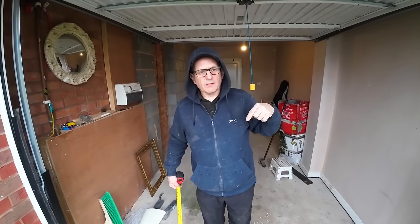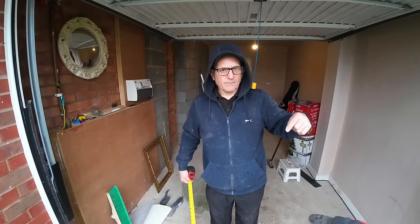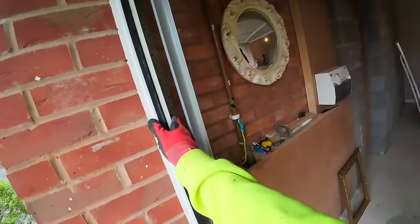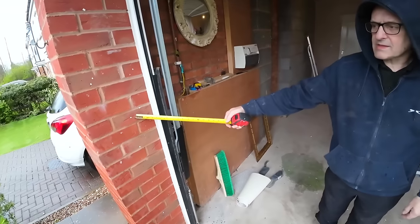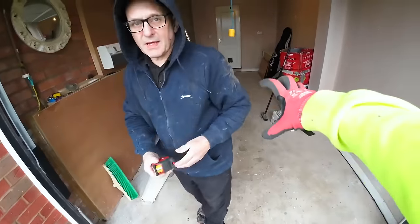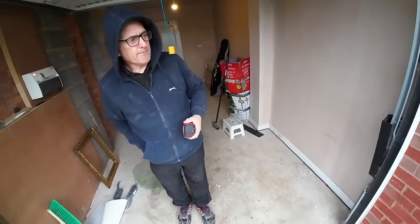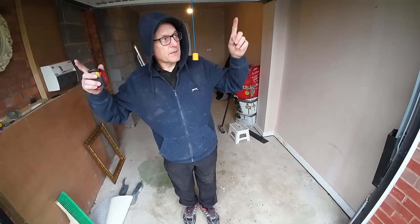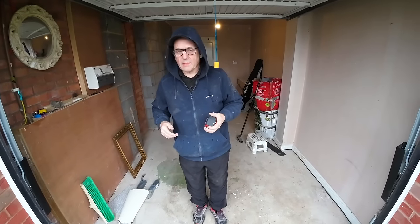Because it's an existing building, we don't have to. We can go off the existing build, since it's already here. We don't have to do the 150mm. Yeah. Plus, it'd just be easier to do the 100, because it will flush up with the wall, and there's no awkward. Yeah. It'll probably be about 125 cavity, that's to flush it up, because that's the 325 pull. So we'll just make the cavity slightly bigger. So we've got 100mm cavity, but we'll use the 0.32 insulation that we always do. Cavity tray, groove, tooth out, and the Robbies are going to build a frame to build in like we normally do, which is really useful. Yeah. A lot quicker, it's instantly secure.